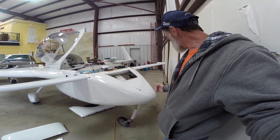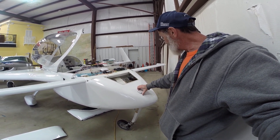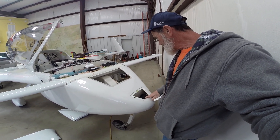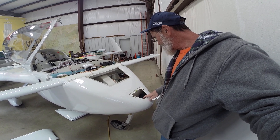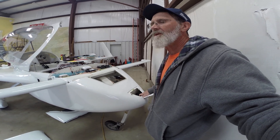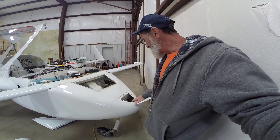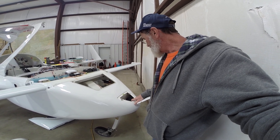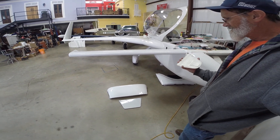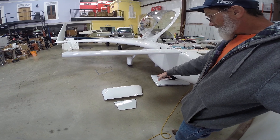It still works pretty well. The front ballast area — I carry 50 pounds of lead shot in here when I'm solo to keep the CG just forward of the aft-most limit, about 101.5 inches. There are covers here, and those are pretty close to plans except for the larger canard cover.